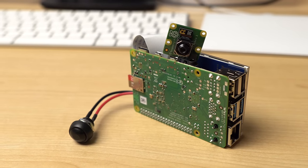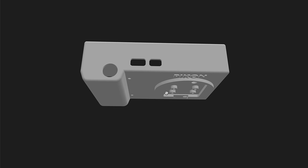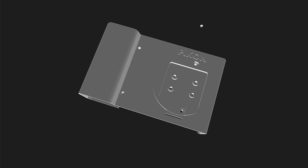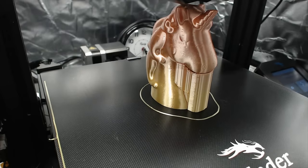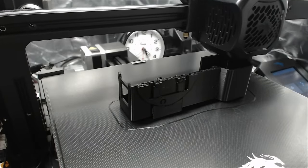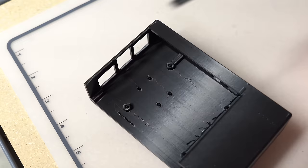I dry-fitted it all together outside of the case, and it's already looking pretty good. To fit my parts into the PiCon case, I had to modify it a little. I'm using a large pushbutton for the shutter, so I added a hole in the case for it. The PiCon was built for the HQ camera, not the camera module, so I modified the front mounting holes too. I tried printing with rainbow filament left over from a unicorn I printed for my daughter, but that filament doesn't work as well for a precise print like this camera case, so I swapped back to black and printed another case, which printed perfectly. I have instructions and code for everything you see here in my Pi Camera GitHub repository — see the link below.